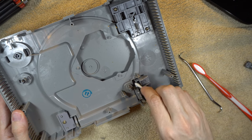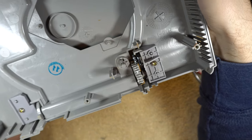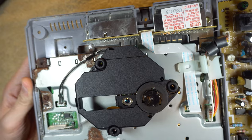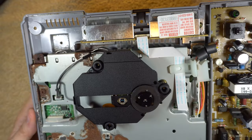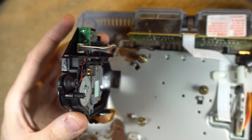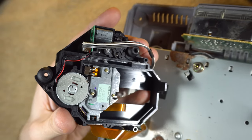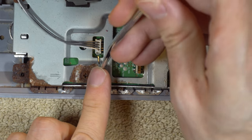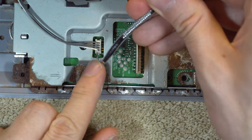That's one of two things I want to do to the PS1. When I repaired the door in the last episode I also blew dust away from the inside, but the CD drive did not work as well after that repair — even though I barely touched the laser unit. It's just not loading games well. I was trying to play Driver and it would freeze during loading screens, though some other games seemed unaffected. I read that turning the unit upside down can help, but in my case it didn't work at all upside down. Eventually the laser started making a weird noise I hadn't heard before. I didn't film that, which is why I'm describing it — so I'm going to try servicing the laser to see if lubricating it helps.